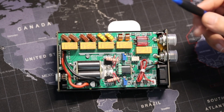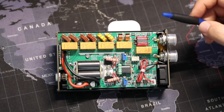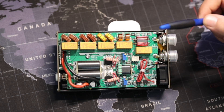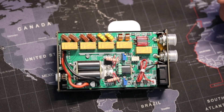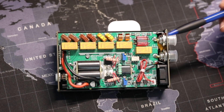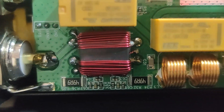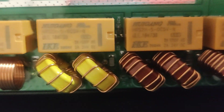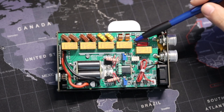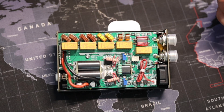Some people have compared this to other amps out there in the comments. I did look at the OGS50, but it doesn't have a low-pass filter — you're always going to have problems if you want to stay within band specs and minimize harmonics. So I think this setup — the ability to RF sense and automatically change bands with the LPF to clear out those harmonics — is going to work great.